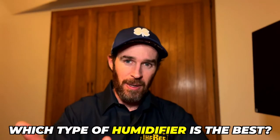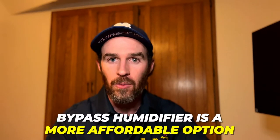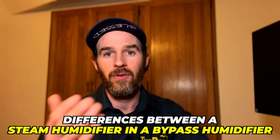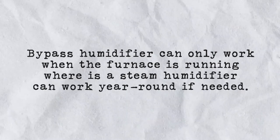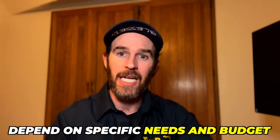So which type of humidifier is the best? The answer really depends on your specific needs and circumstances. If you live in a very dry climate, a steam humidifier will be more effective. However, for homeowners looking for the best bang for your buck, a bypass humidifier is a more affordable option and will still add some humidity. The downside is bypass humidifiers don't produce as much moisture and waste more water. Another key difference is that a bypass humidifier can only work when the furnace is running, whereas a steam humidifier can work year-round. If you can afford it, we always recommend steam over bypass if you have extremely low humidity levels, although both will take the sting out of the air if you're just looking to reduce static electricity.